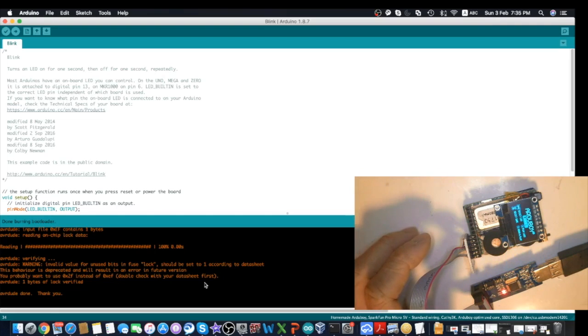Even though the serial flash is empty, as long as the bootloader detected you got a serial flash, this menu screen will come up. If there's no serial flash, then this one will not come up, and you may get a serial flash error icon. So double check your wiring if you don't get this screen. Next, we can start to put games onto this.